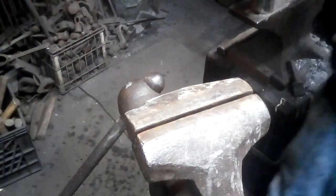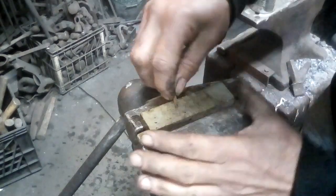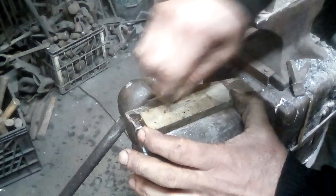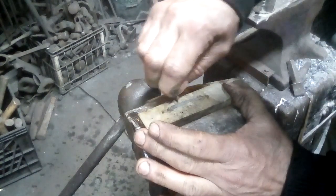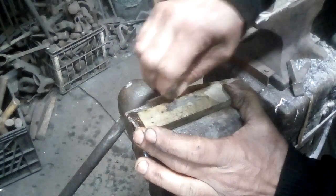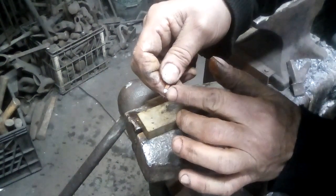Now, I have a fine sharpening stone, and I'm going to smooth out and take the burrs off of the end of this thing. So I start with the back bevel, and I'm just holding the flat on there, and this smooths out the back. And you can look at it and see if you've got all the grinder marks off. And you don't want to rock it, because if you rock it, it'll round the edges of your tool. So that's the back angle.